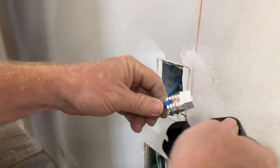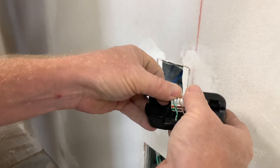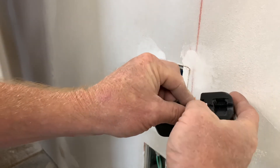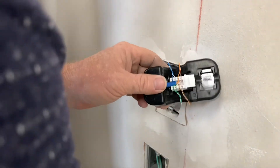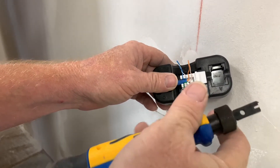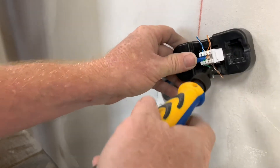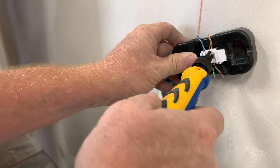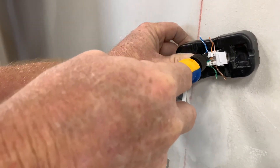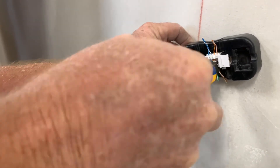You can do this in the palm of your hand, but it's kind of a pain. So I've got this little tool — you just drop this down in. And then we've got our punch-down tool. It's got a little sharp blade on one side that's going to cut off our excess wire hanging off the sides. Make sure you pay attention to what side that blade is on before you do it. Then we just push it down in there and give it a couple clicks on each one. Switch it over — don't want to cut the wire on the wrong side. Do the other side.